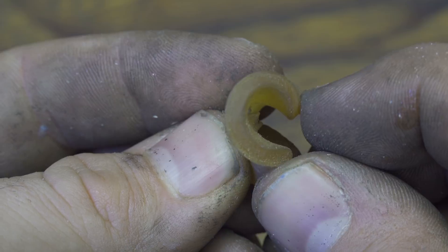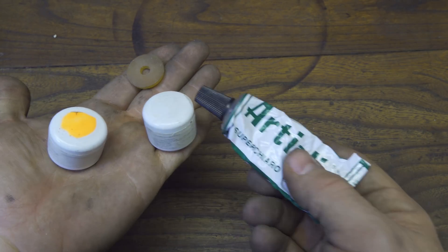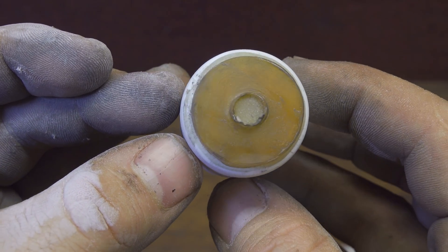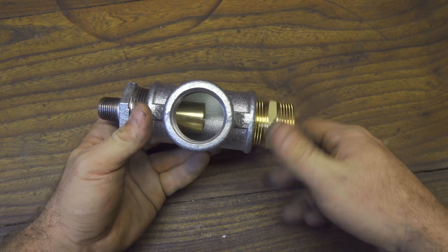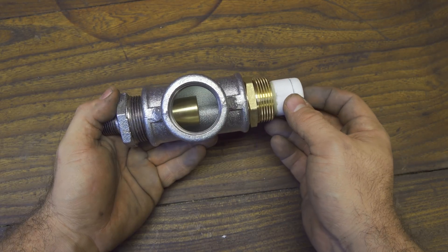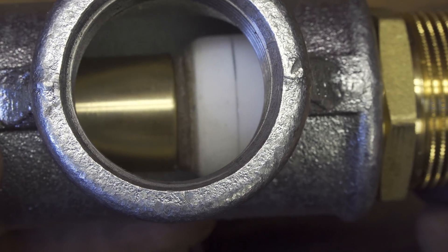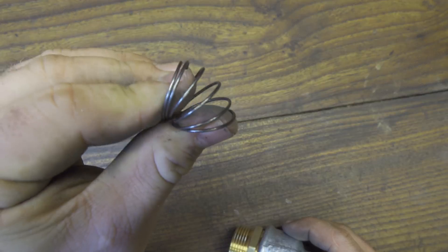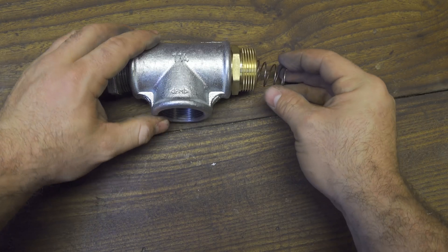These two parts have to be glued together with a rubber gasket. This is one used to seal and close beer bottles. This is the result: we have the rubber on top and the plastic piston ready. The brass part goes inside the valve along with the piston, and as you can see the rubber gasket seals the half-inch brass pipe perfectly.